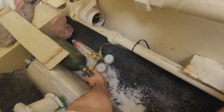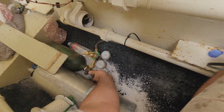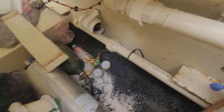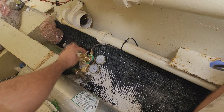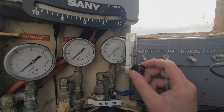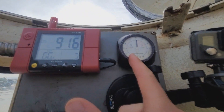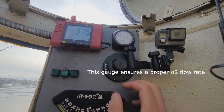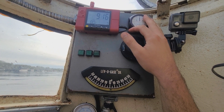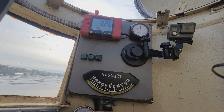Right here is our oxygen tank — we're going to open that up now. This is a smaller tank for a couple-hour dives. I've got a bigger one going in because I'm planning an eight-hour underwater challenge. Here's our milliliters-per-minute gauge. The human body absorbs a few hundred milliliters a minute depending on breathing rate, so I like to start around 400 to 500 and calibrate on the dive using this cabin pressure gauge, which I'll set to zero before sealing the hatch. If pressure drops inside, this gauge goes negative; if it's high, it goes positive.